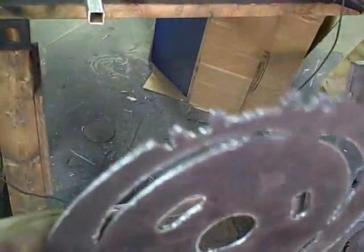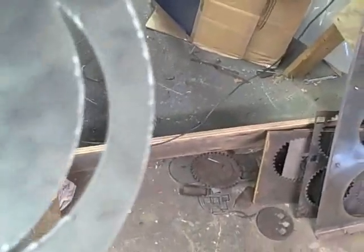I'm going to let the air compressor stop and then I'll resume. Okay, I popped the pieces away that aren't desired, and you can see there's still a fair amount of dross on the edges — some of it's falling off. This stuff's really brittle, so I'll take this piece and just tap it on the floor a couple of times, and as you can see that pretty much gets rid of it.